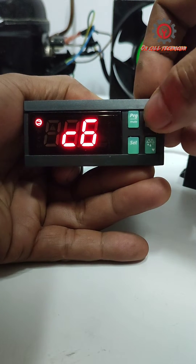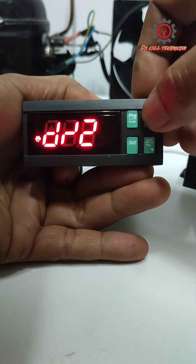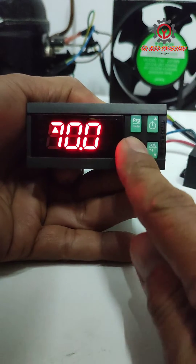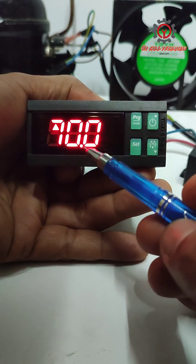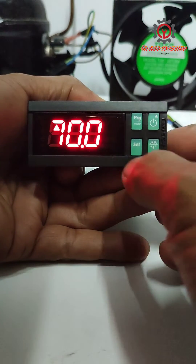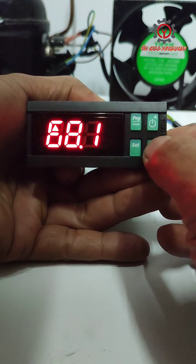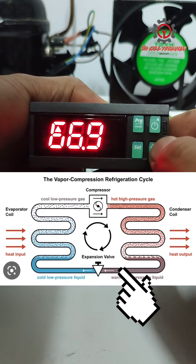The AC parameter stands for high condenser temperature alarm. The manufacturer sets 70 as the default value. If you want to put 50 here, go ahead, but install the sensor between the condenser and the filter dryer.